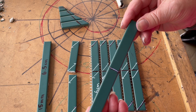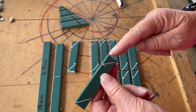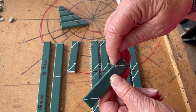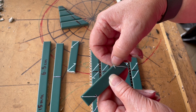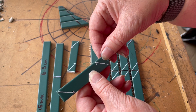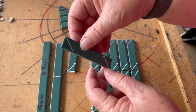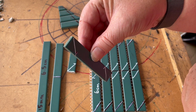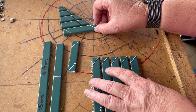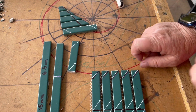On one of these, the easiest way to do it is to cut your long tile in half. Then, because it is 15 mil across here, you go in 15 mil and draw a line from there to the point — I do that by hand because I want it to look a little more organic. On the opposite side you do the same thing, so you end up with this arrangement for going down in a spiral. As you can see when I cut that off, it starts to go down.